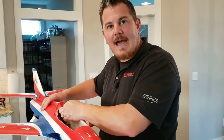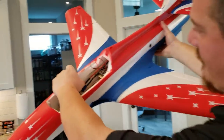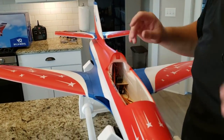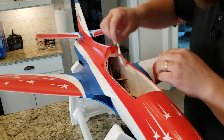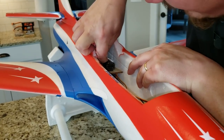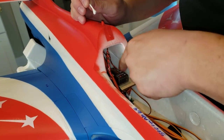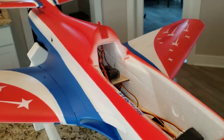So here's the thing. If you can keep that protected portion, you never want to kink it where that sheath ends, that gray part, okay? That gray part right there. You see where my thumb is? You want to be super careful at that point. Because if you break it there, your antenna is not going to work. It's going to work very poorly at best. Okay, so now I'm going to use this soft thing, and that's why I'm being super careful at this spot, because when I cut that, I want it to dive down into my slice. The slice, it's my favorite part, says the crazy weirdo.